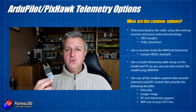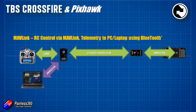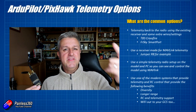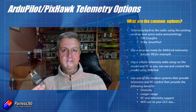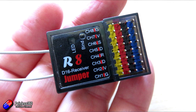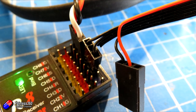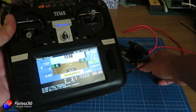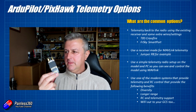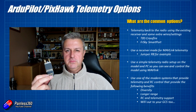If you're using Crossfire, it supports Mavlink, which is the telemetry protocol that the Pixhawk talks natively. You can connect Mavlink into your Crossfire receiver and that will come down. See the Crossfire series for how to do that. There's even a specific receiver from Jumper, the Jumper R8, designed to do that too — two ports that you plug the Mavlink transmit and receive pins from your Pixhawk telemetry port into, put YAAPU on your radio, and away you go. So you don't need a telemetry radio if you only want to get the telemetry streams back.